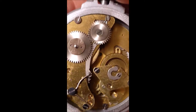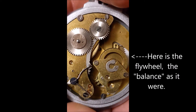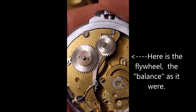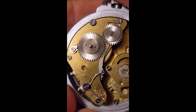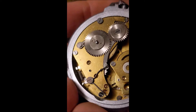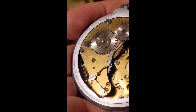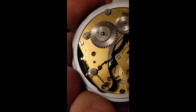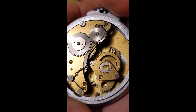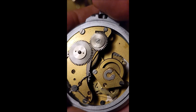This big flat disc here is kind of the equivalent of a balance. When I push on the crown, it engages this pusher that you're seeing running down to the middle of the movement against that spring. And when you look down here, there's a star wheel. The star wheel's got some apparatus — you'll notice a tension spring there. What that star wheel does is frees this up to do its business.